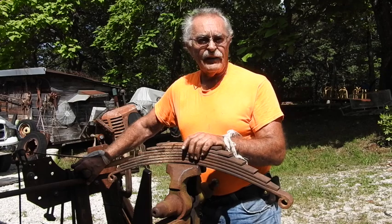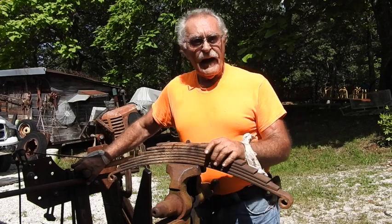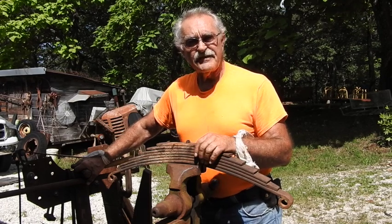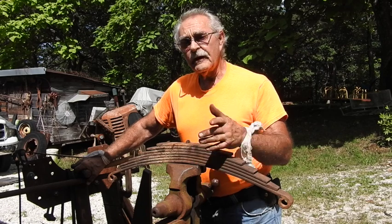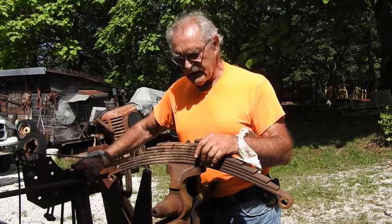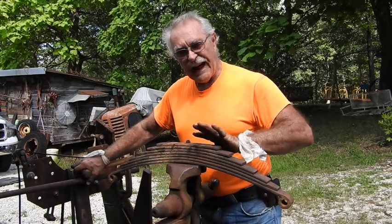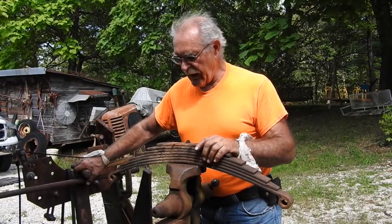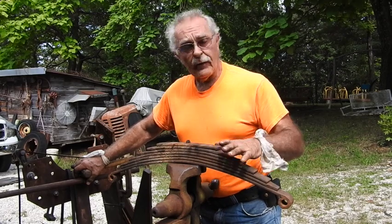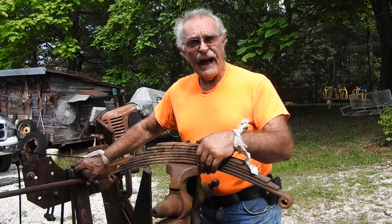This is all being built out of salvage material. You find yourself in a situation where you have springs that are just way too high a capacity for what we're going to be hauling. This little bandsaw has very little weight at all — even compared to the frame of the trailer I'm building, the bandsaw is probably less than half the total weight. So this stack of springs is totally not required. We're going to restack this spring with fewer springs for two reasons: number one, we do not need the capacity, and number two, we don't want it setting that high. We want to set it as low as possible for ease of operation.